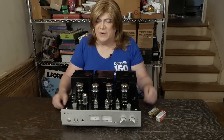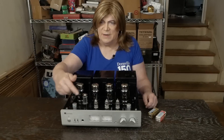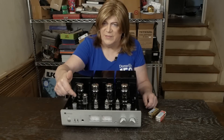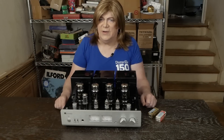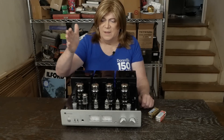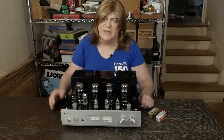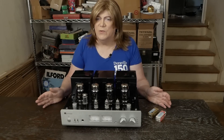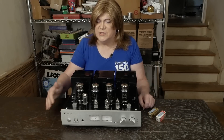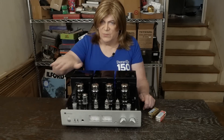The other thing I like much better is the way they do the bias adjuster — it's got a meter for both channels and it actually shows you the milliamps it's set to, unlike the R8 that's just got a center position. I also saw that they say this amp isn't really set up to run EL34 tubes, but I see no reason you can't run lower-power EL34 tubes and just adjust the bias to fit that tube's wattage profile.